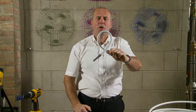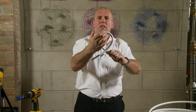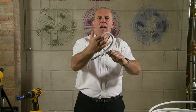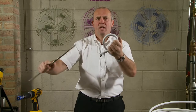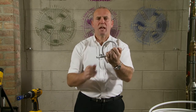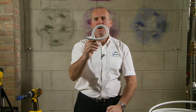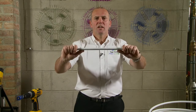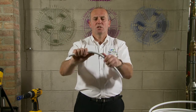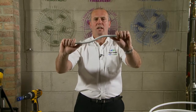You wouldn't be able to do that with copper — by this time you would have had rippling and possibly the pipe would have either split or collapsed onto the actual spring itself and you wouldn't be able to take it out. There you can take the spring out easily and if your customer is not happy with that configuration in the house, that can then be straightened out, giving you a second chance. You can also do offsets with the pipework quite easily.